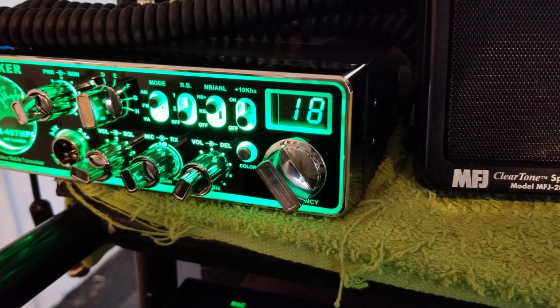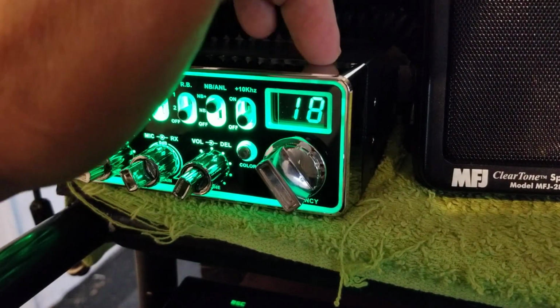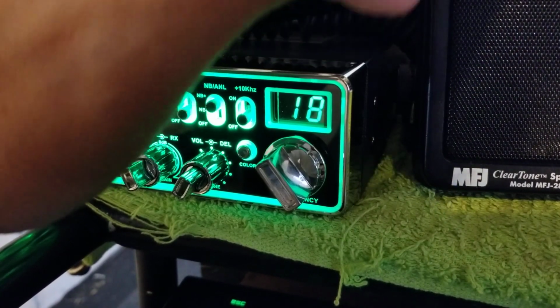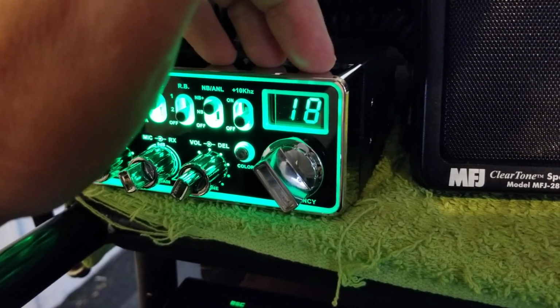You get a lot of guys out there with a clean sounding radio, but their audio is very low. And the techs go in and cut the limiters and overmodulate them and make it dirty on the scope, when that's really not the answer. The answer is to have it clean on the scope and have loud audio.